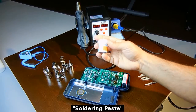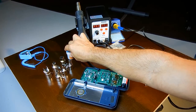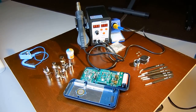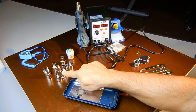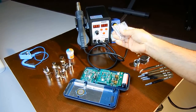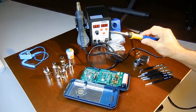The solder and flux I use is 63% tin and 37% lead. This melts around 185 degrees Celsius. It's perfect if you have stencils for going over the areas where the IC is going to sit. Or you can take a very small needle and drop a little bit on each pad, position the IC, and then apply the heat. When you purchase the unit, you get the three round tips — small, medium, and large — and with the soldering iron you get about 10 tips, all different sizes including chisel points. It's really a great deal.